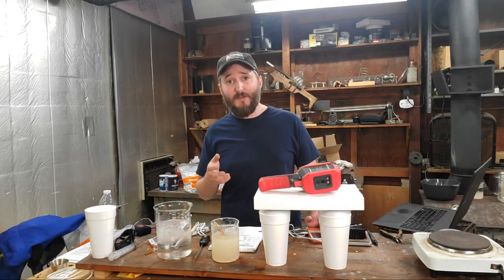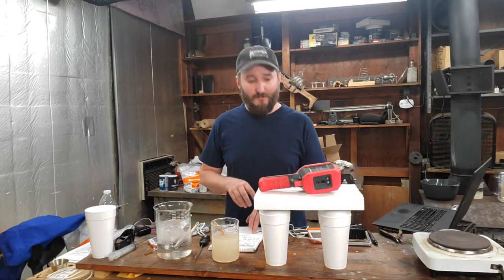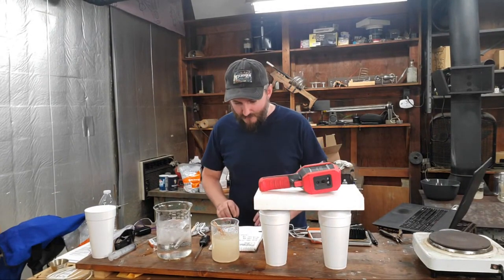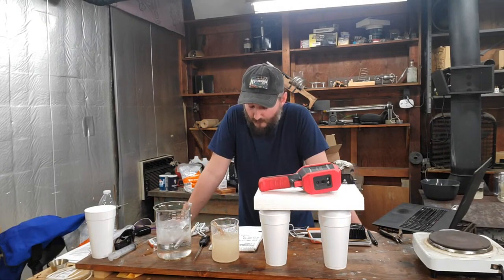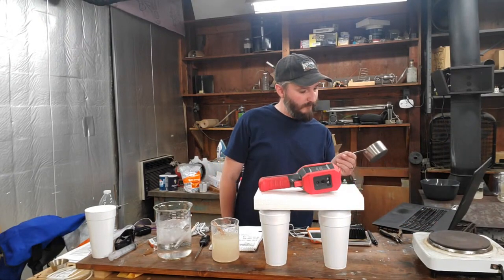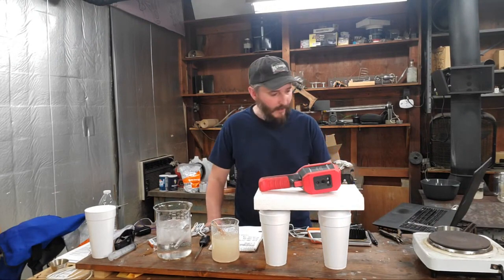But of course that makes sense because we used much more of the phase change material. I was able to fit a lot more by weight into that little baggie than I was for the ice. And so it's not going to be a fair measurement until I actually plug it into the equation and figure out how to do that, because I just realized what I need to do is calculate the weight of the water, which I know was 236 times 2 grams, by the amount of change in temperature that it has.